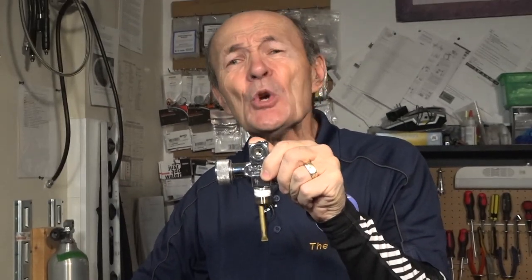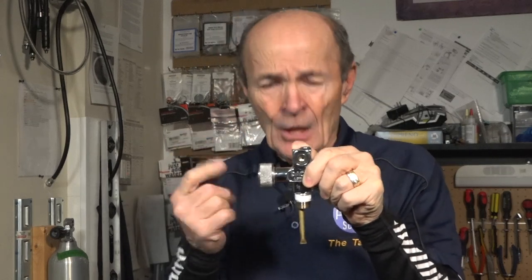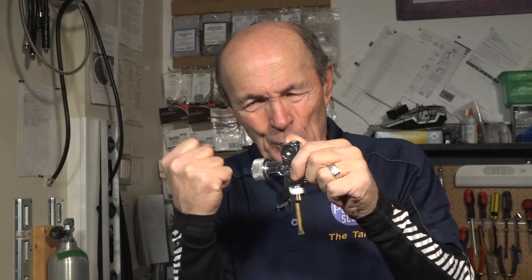The Teflon tape does two things. The first thing it does is it lubricates the action of the valve going in so that the metal to metal doesn't grab and grip and maybe tear and injure the threads as it's being forced in, because it is forced in. Not like a 3/4 inch valve.